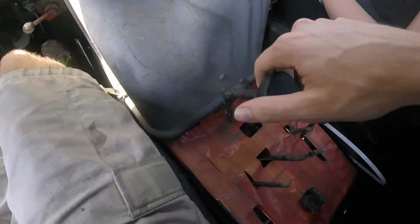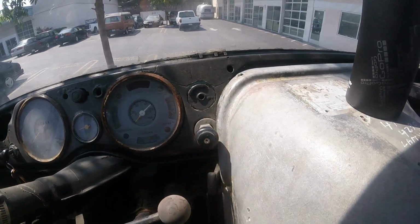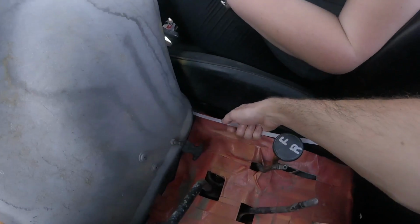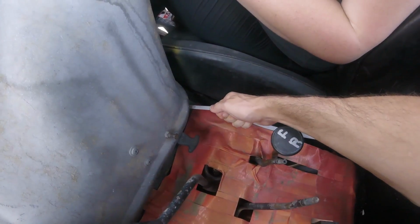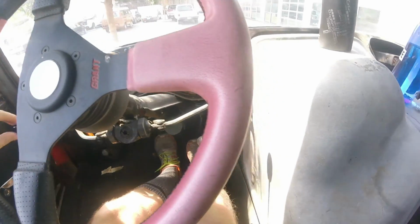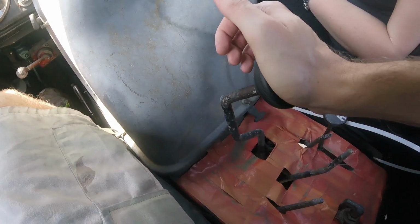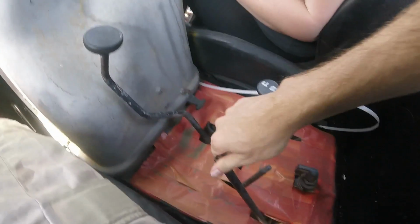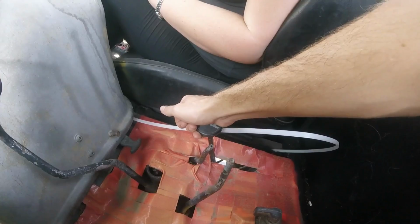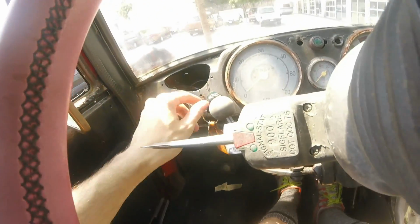gear. Neutral. Clutch in, push the hand throttle all the way back to idle, and then pull to starve the engine of fuel. And then to park it, there's no emergency brake. Just put it in first gear, crawler range, and probably reverse so that if you accidentally get started backing out, you at least go backwards. And that's how you Unimog.